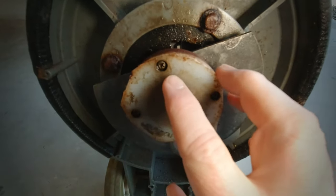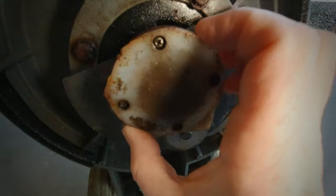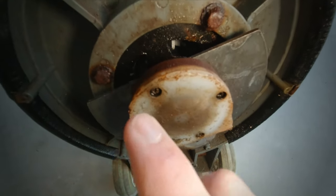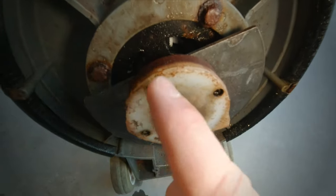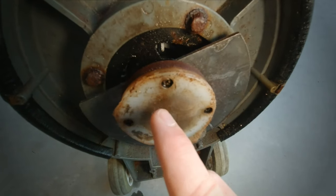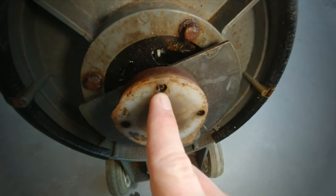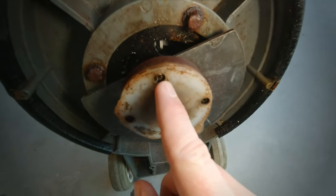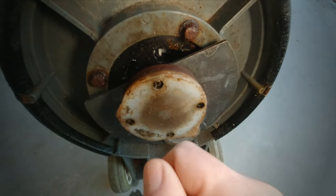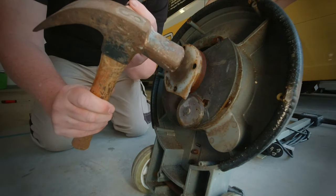This is the underside of our machine and as you can see they've used these real fine Phillips head screws to hold the plastic holder onto the bottom of the machine. I tried this the other day and started rounding a head so I stopped, soaked it over the last couple of days, and now I'm trying to find a solution to get these back out. The first method is getting a real fine centre punch, impacting on the centre of these screws to hopefully shock them and work them loose, and then you should be able to gently wind them out with a correctly sized Phillips head screwdriver. I've got my fine centre punch and my trusty old hammer.